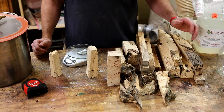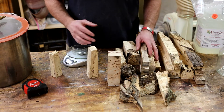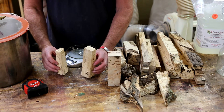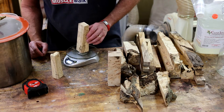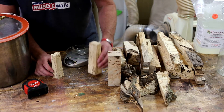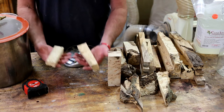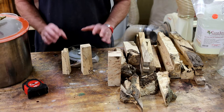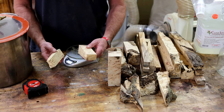So I have all these pieces rough cut for stabilizing. Most of these I'm going to reduce the length so that they fit in jars to make it practical, but these are the first two I'm going to try — sort of my experiment. Before I can infuse them with resin I have to dry them, so before I do that I'm actually going to throw them on my little balance. This one is 59 grams and this one is 36 grams. If you were to pick these up they weigh nothing — it's really surprising how light they are. It's going to be interesting to see once they've been infused with resin; they're probably going to be multiples of that weight.